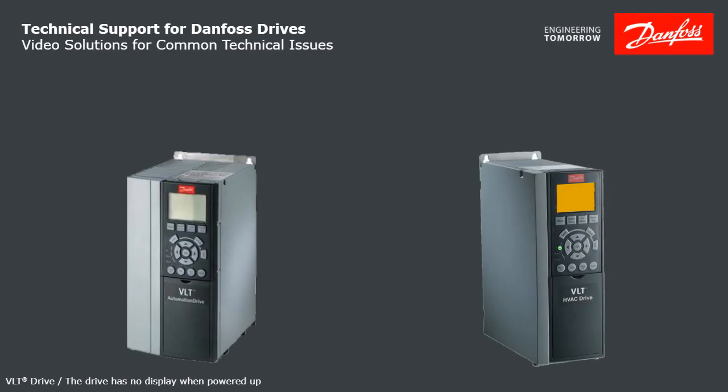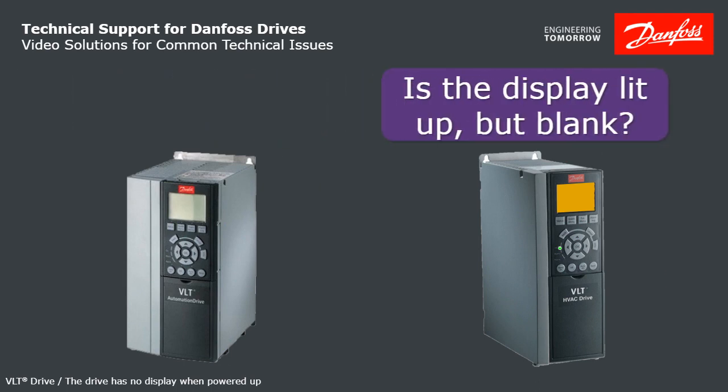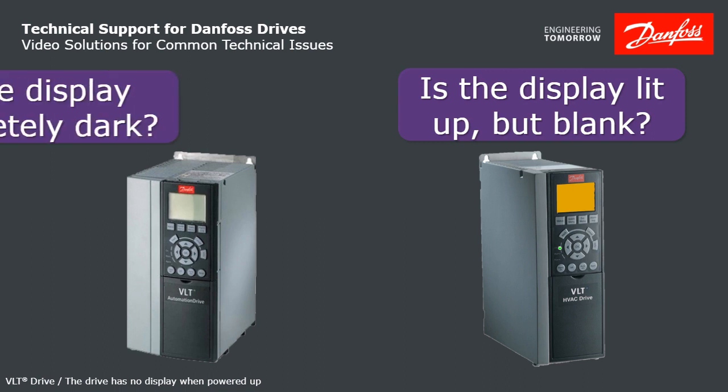I'm going to explain what to do with a Danfoss VLT that has power applied but no display. So you have a VFD with power applied and no display. I'll tell you what to do about that. First, let's clarify. Is the display lit up but blank, or is it completely dark?